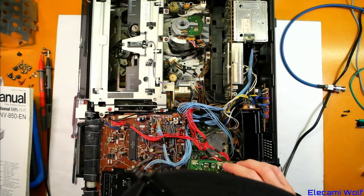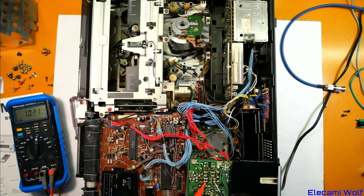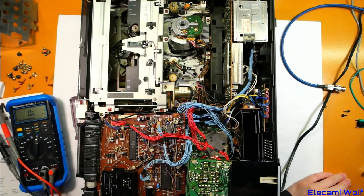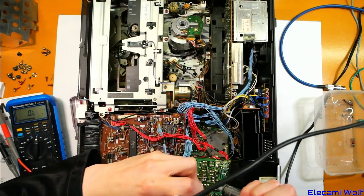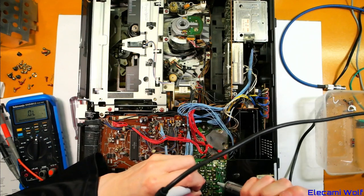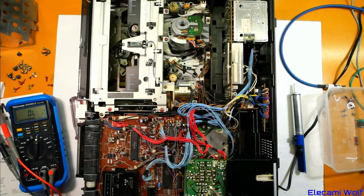So maybe the diodes are fine. Can we measure them in circuit without having a problem? I don't think you can properly measure them in circuit — you're just seeing the other ones. So either they've shorted, or that shows nothing, or maybe there is a shorted diode. First we should take them out and measure them. Try desoldering the diodes and then we can measure them out of circuit. They're not going to properly desolder out of there — well, just as well I've got some replacement tips for this thing, it'll get melted away. Okay, those should pull out. Let's check the diodes out of circuit.